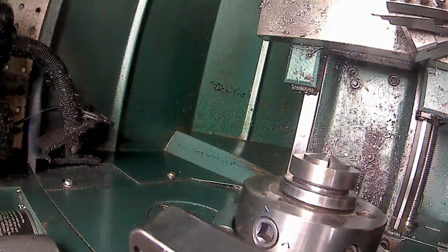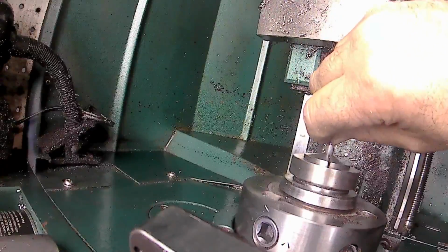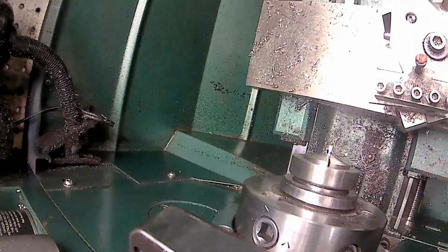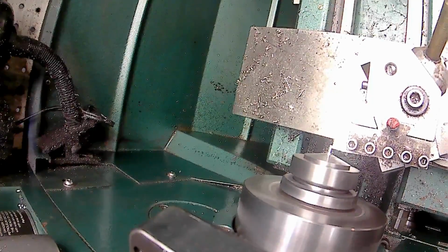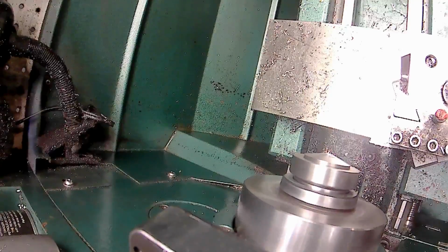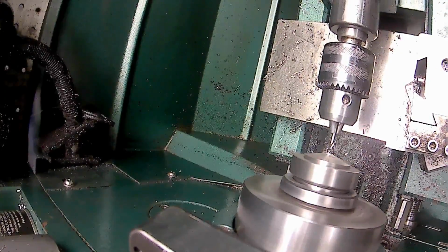Now I can put it into this, what did I do with the sleeve? Alright, I can put it into the sleeve up to that line, or close to it. I'll clamp it in the collet. And now I will turn the extra length off, and it's right up to the collet. Like that. Then I'll further drill it, set up and drill for the 172 diameter, or thread.